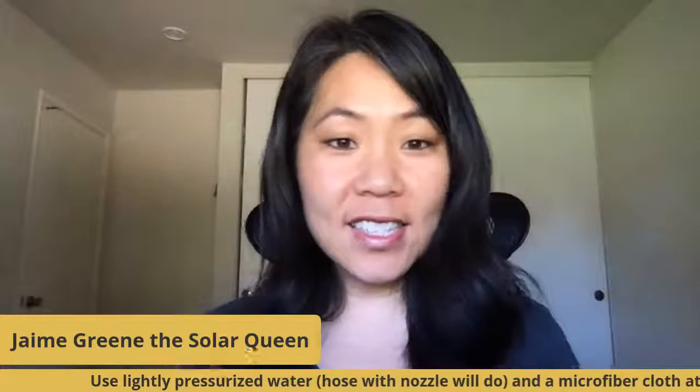Yeah, so if you're not comfortable doing that, you can definitely hire it out. So that's going to be a tip down the road. The third tip, do not use fancy cleaners. You don't need fancy cleaners to clean your panels. You don't need to use dishwashing soap. You don't need special high performance cleaners that are going to grab more sun to reflect. Don't use fancy cleaners. Just use water, and a microfiber cloth if you can.